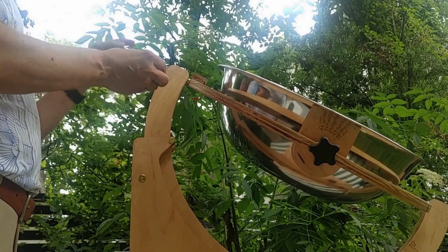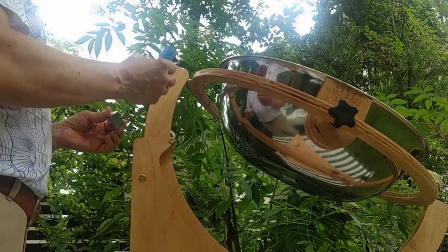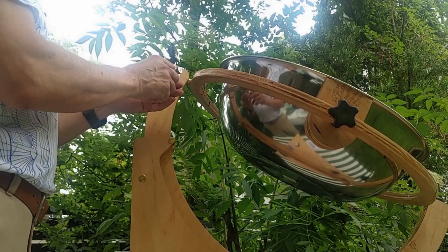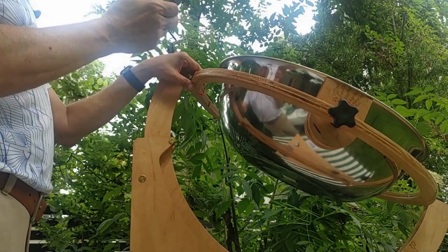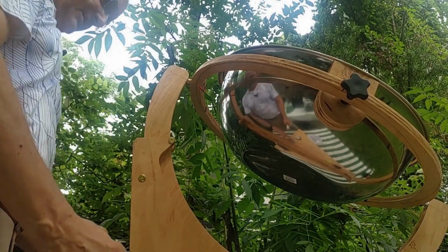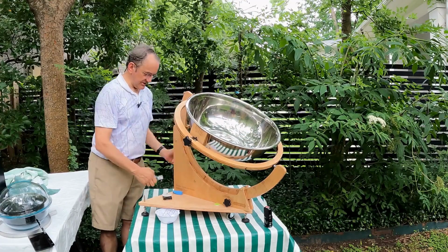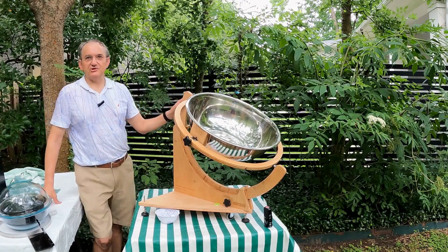And then right now I have this tiny little motor in here, which, like I said, wasn't quite powerful enough. It works, I got it turning, but it wasn't quite powerful enough. So that's probably gearing. I have some bigger motors, and this is the style that Stan uses. So I know it can turn a wheel. This one is 6 volt. I was doing 3 volt right now, but this is 6 volt, 3 RPM, so it's very high torque. I'm sure it can turn it. Probably I just need a bigger wheel. But so there you have it. That's the quick rundown of what I've been doing since you were here last.